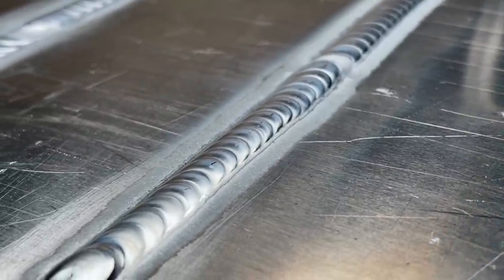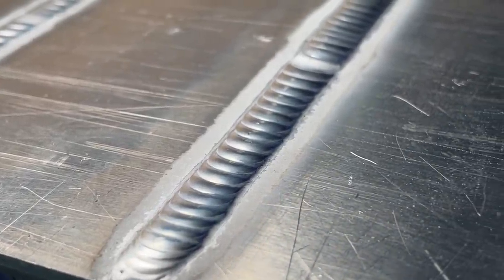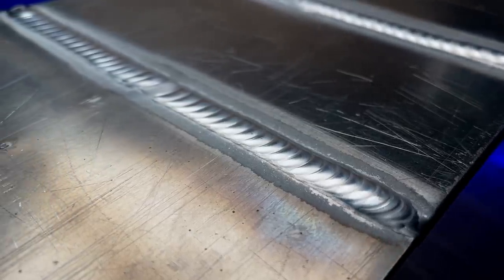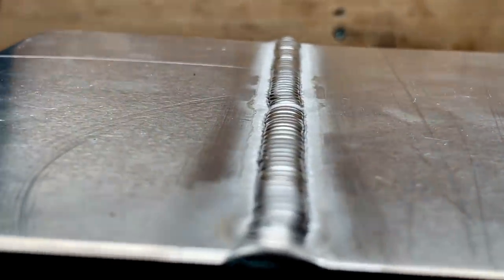We see these puddles blend out a bit further. In doing so, take a look at how our edges will change. Approximately the same amount of filler material, but we get a very different result. We see the line on the edge becomes straight and blended properly, and our filler material has a much easier time blending out all the way to the edges, whereas before it was stacking up in the center. So we took a look at a few of the things that were absolutely a problem with this joint, and in doing so, we tried to figure out what was actually causing this problem. Now that we know what that problem is, we know exactly what we can work on next practice session.